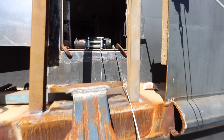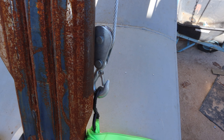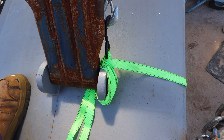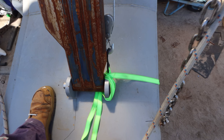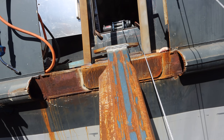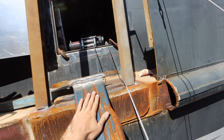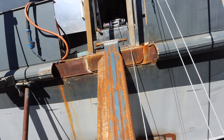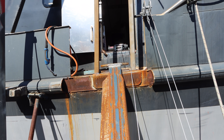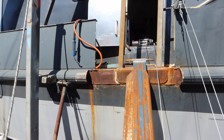What we decided to do was hook it up. We've got a two-to-one purchase. If I show you right down the bottom here, that's the pulley on a two-to-one — we've just got a strop hooking around the cheek down here, and that's allowing us to lift and lower the wing. We're going to weld a beam across here that allows this to slide on the outside of our sliders, functioning basically like a slider, so we don't have to hold the arm as we're lifting it up and down, and then we can crank it up and down with the 24 volt winch.